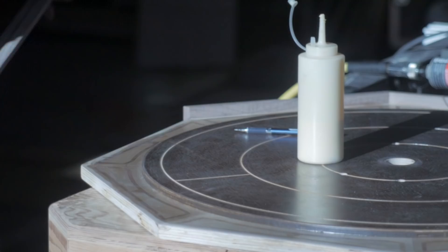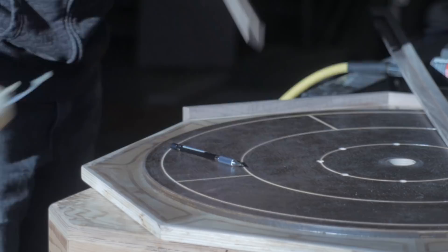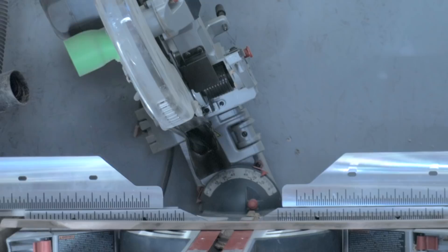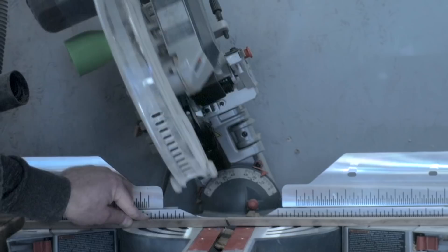The trim was cut from a few sticks of walnut flooring. I cut a small rabbet into my boards, but that's optional — you could just use a thin board glued straight to the side of your base. To cut these, I just worked my way around the board: cutting one angle, lining it up on the board, and marking the next angle cut, then rinse and repeat. These were all secured with some glue and a few pins to hold it while the glue dries.